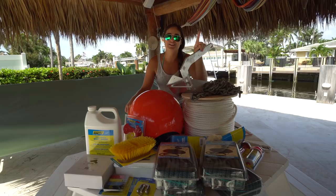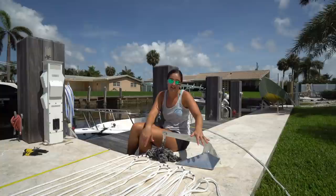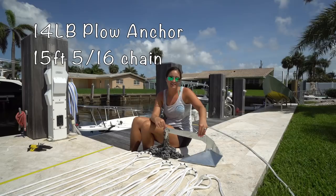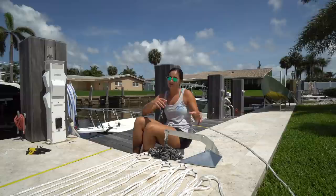The first thing we're going to do today is put our new anchor chain and rope into the boat. Behind me is my family's 247 Edgewater. We've had the boat for about six years and we've learned what works for us for anchoring. We've gone through a couple different kinds of anchors — we tried a Danforth, tried one other style — and this plow anchor is what works best for our style of fishing. This is a 14-pound plow anchor. We're going to put on 15 feet of 5/16 chain as well as 600 feet of half-inch double-braid nylon anchor line.